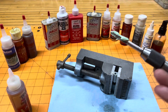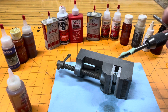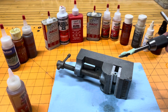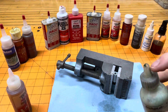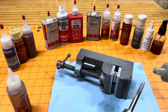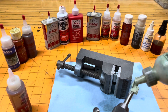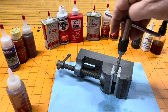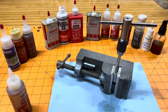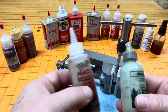The nice thing about Anchor Lube is if you're tapping over your head on an I-beam, it's not going to run off — it stays put, which is kind of the idea behind the name. So I thought, how do I come up with a solution that's a cross between both of these? I have a smaller Anchor Lube bottle where I cut the top off pretty big, and I put some of this on there — it flows a lot easier and stays in place. I took some Anchor Lube and some Tap Magic and combined them in this bottle.